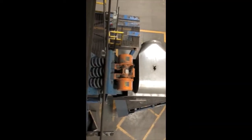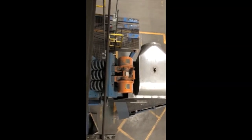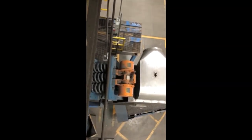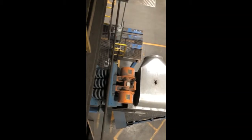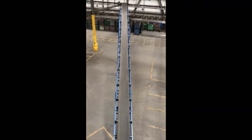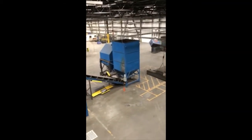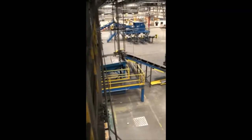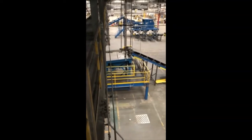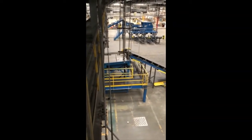After the magnetic separation, the material went through a destoner that removed lights and heavies so that uniform material would be presented to the Titech equipment following this. The feed out of the destoner was on this conveyor into this hopper, which fed this Titech finder system, which would separate metal from non-metal items.